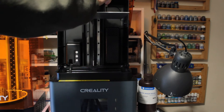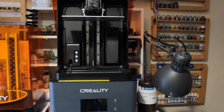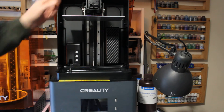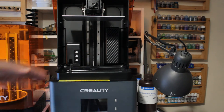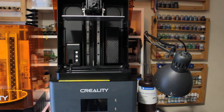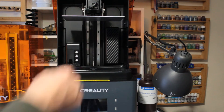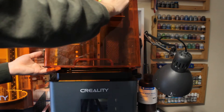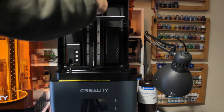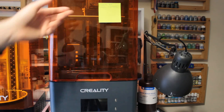I also have the habit of after cleaning, I wipe down the build plate and just put it back on while I'm sorting something else — without screwing it in. I then press print, it goes in, and all of a sudden it's doing this loose wobble. You have to get it right. If that happens, just cancel the print, clear the bed using the clean function and start again. There's no point waiting two or three hours hoping it will be okay — it never will be if the base layers aren't right. Post-it note: screws out, check tightness, clean, screws out, tighten down, enough resin in the vat, shut the top, then print.